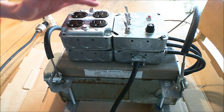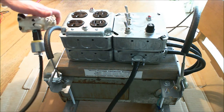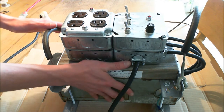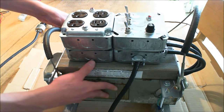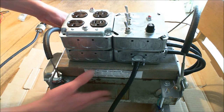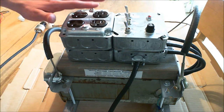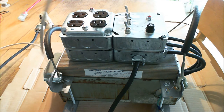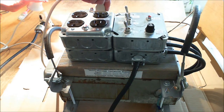What this does is it essentially takes the mains power, which I am sourcing right now from the electropup here, and converts it into a magnetic field within the core of the transformer, and then that magnetic field gets converted back into electricity on a secondary winding. This eliminates all electronic connection between the primary and secondary, and thus between the ground-biased mains power and the output power. I'll show you it's generating the desired voltage here — this light bulb lights up, so we definitely have power.